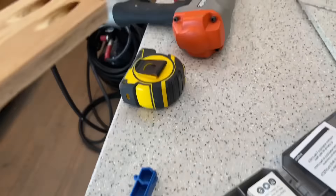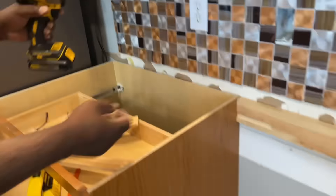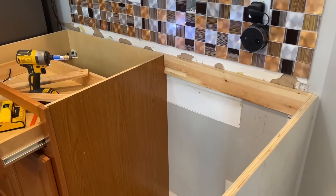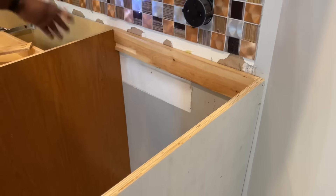I did have to put a couple of screws in there which I'll putty up — that's fine. This is the backer board and I'm going to screw that here. I use a countersink bit — it has a drill bit and countersinks the nail head — so I drill right in the corner and then one below. That makes it easier when you get ready to drive the screw. I glued this side, not that side — it's not necessary because this panel isn't moving since it's part of the whole cabinet.